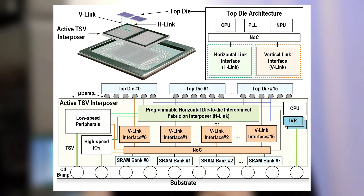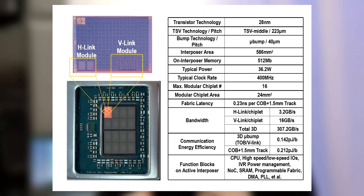What you're seeing here is a standard silicon interposer, but it's active. It has SRAMs and two lots of networking on top — whether you want to bypass or go through the SRAM into main memory. It also has an Ethernet controller, Ethernet IP, so you can connect into the chip like an attached accelerator. It also has control logic and assists with power delivery. On top of the interposer, you have eight compute chiplets, which in this case is a RISC-V core plus an AI accelerator.